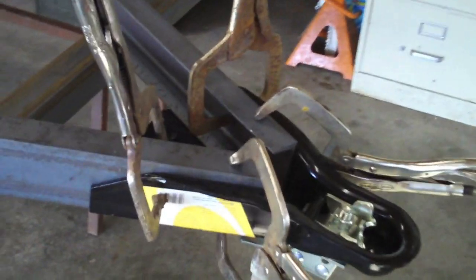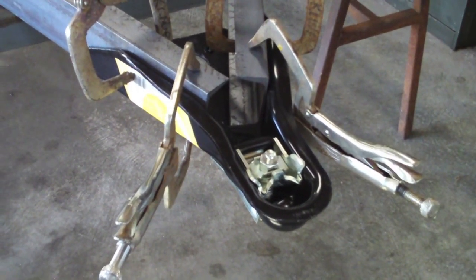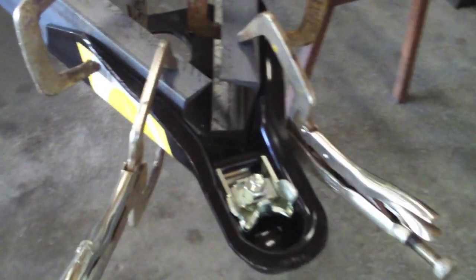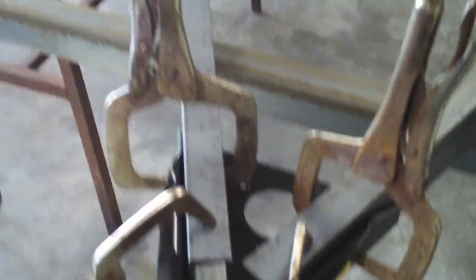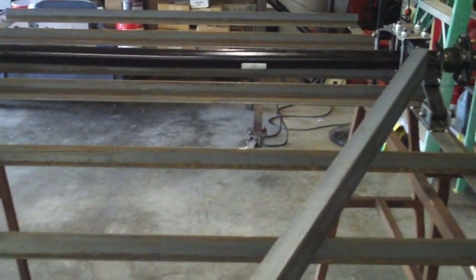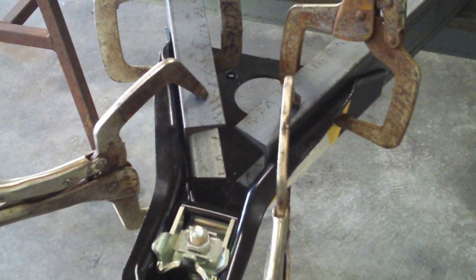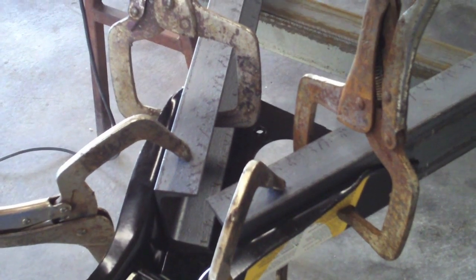Here's the hitch — I'm using a standard A-frame hitch, 50 degrees. This is completely standard, you'll find it in any store that sells this kind of stuff. For the hitch itself I'm using three-inch channel, 3.5 pound per foot — that's how they classify that stuff. I just wanted to show you how I set it up and give you the dimensions.